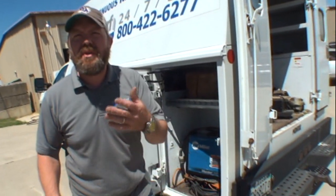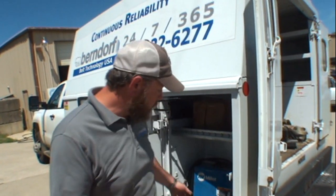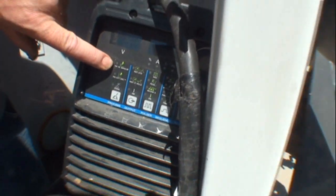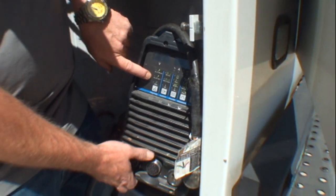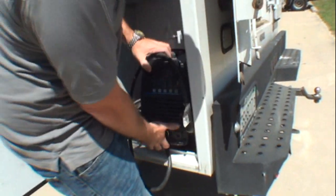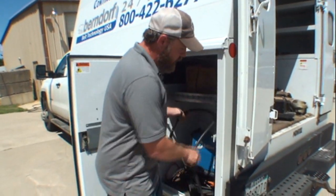You could do TIG, you could do MIG — it's all in one. For around three thousand dollars, you can do stick welding too with the right settings — you don't even need an adapter. You got a high-frequency setting for aluminum, bump it down for DC TIG, and boom you're on stick. This little machine is a jam-up little box.